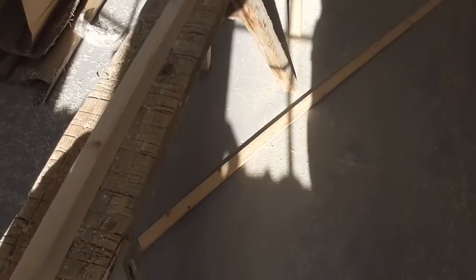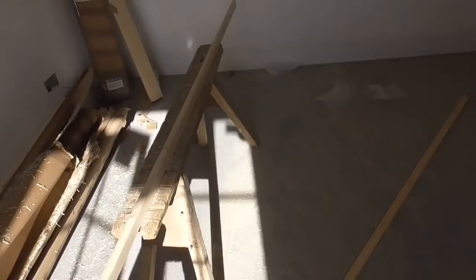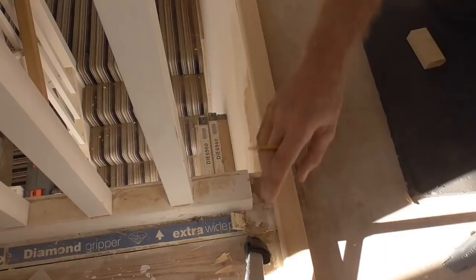So there you go — you saw me just quickly rip down the nosing using my table saw. It's 22mm thick now, which is great, by 40mm, nice little round on there, sanded it up. That's as good as if it came straight out of the mill, so now we can get that fitted and start to move the job along.